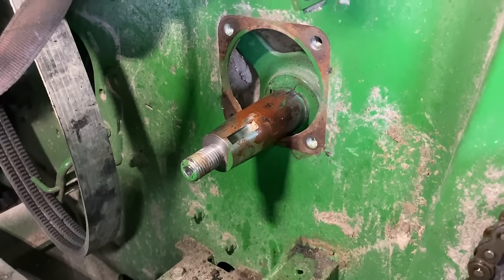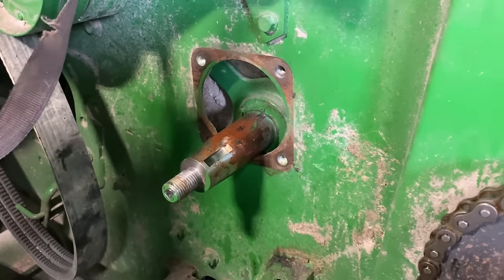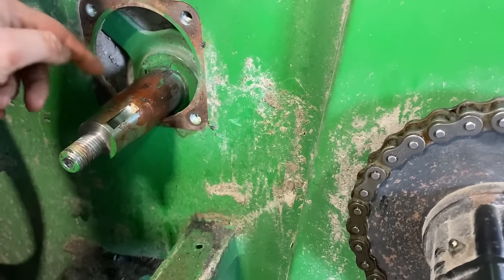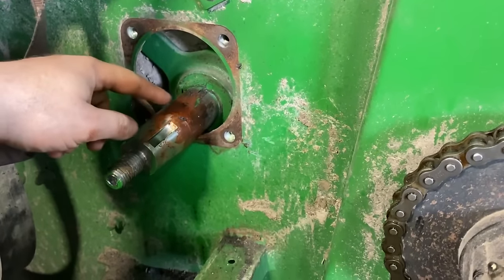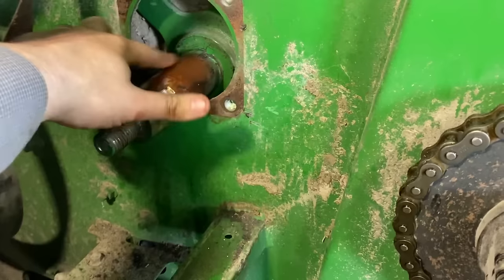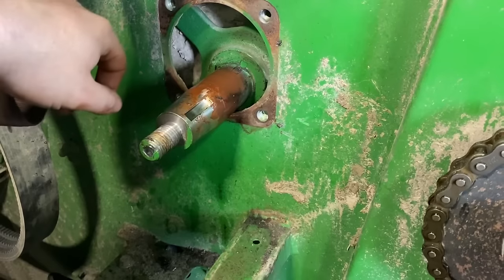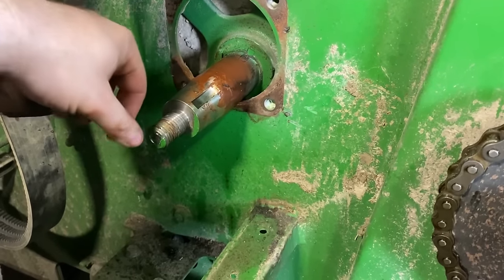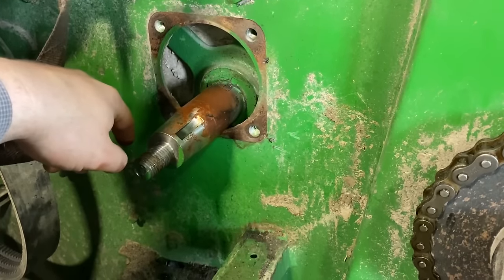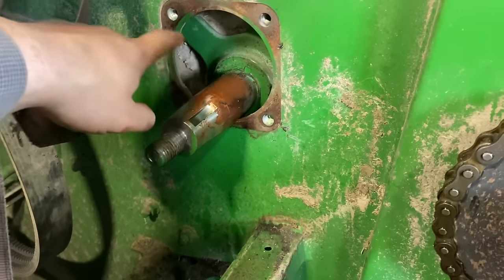Well, I tell you what, that was 10 times faster than trying to torch those things out or take the supports out and trying to get an air hammer on this thing. Once we got that inner race kind of broke, that broke this free to where it could start sliding off the shaft, and using those pusher bolts really helped put enough pressure on there and then rattle in the shaft, and then she come loose. So I didn't hurt the shaft at all. I didn't have to heat it, so I don't have to worry about that shaft getting too hot, which I really like.